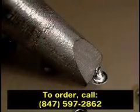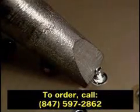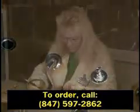When selecting a tip, always select a tip that has the greatest contact area. A chisel tip with a flat surface has much greater surface area than a conical tip. There is, however, a danger in selecting a tip with a contact area that is too large, because it may overhang the termination area and cause thermal damage to the board.